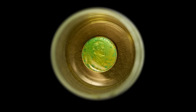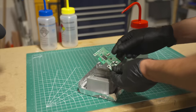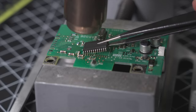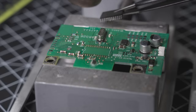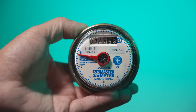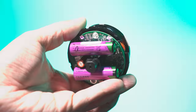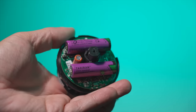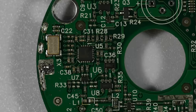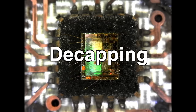In order to dig a bit deeper, we need to take a look at the silicon inside the microchip. This will let us see if it's just a relabeled part, or if it's really something custom and what it might do. Sometimes, as in the case of this water meter I took apart, the unknown part is just a relabeled component — like slapping a different name over the top of a product. I found this out by using nitric acid to dissolve the epoxy case enclosing the microchip. This is known as decapping. This part was just a Texas Instruments CC1100 transceiver chip that was branded differently when sold to this customer.